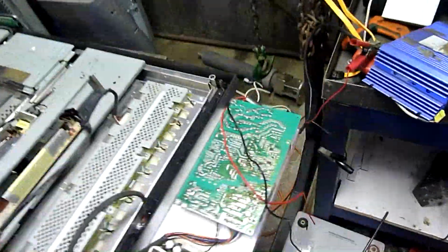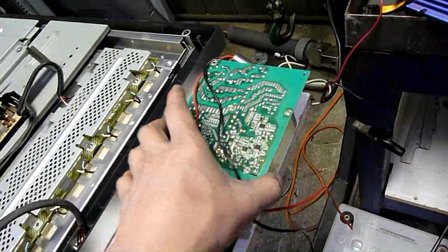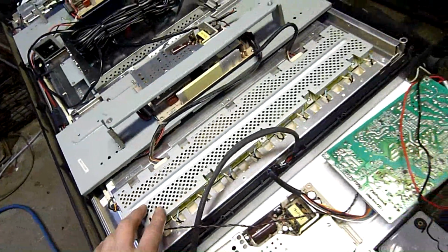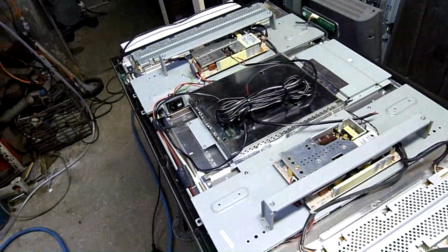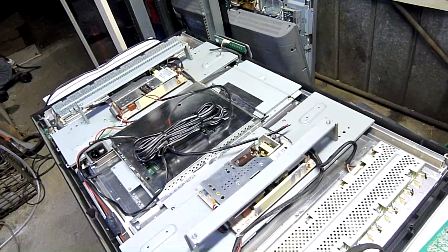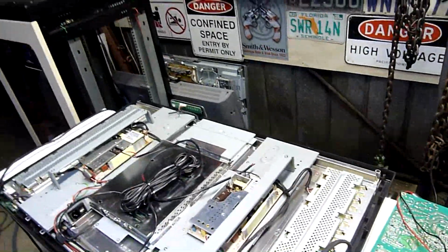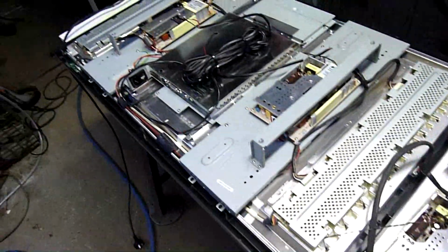These TVs were too cheap to bother really going into any in-depth investigation. But given that they're Taiwanese, it's kind of a shame really. They do put some pretty good componentry in them, like these power supplies. But yeah, they chose to use the 40 inch Samsung panel for the 40 inch model, and well, dead T-con. I couldn't find one for under like $80 or $90, and I'm not going to spend that for something that was falling apart. Like the plastic housing was broken up.